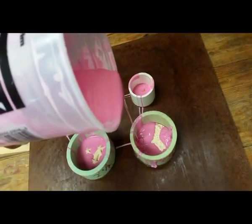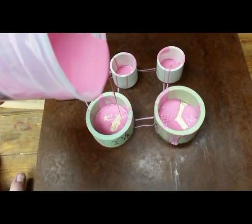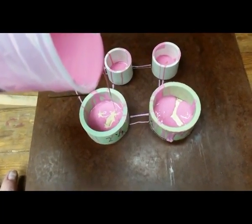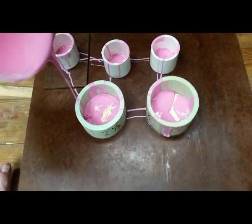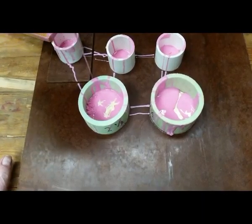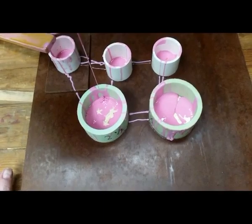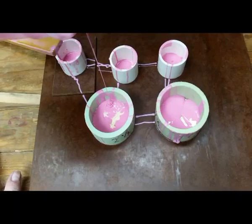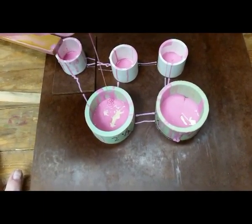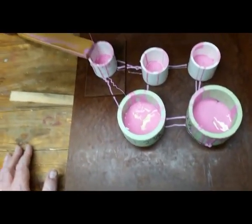These gears have some holes and cavities in there too, so I want to be careful not to pour too quickly on those as well. Starfish is not that critical. They're so small, and the detail in it is so small and shallow that they do pretty good. Go ahead and pour on those. So it fills in the details easily because they're not deep. Right. But like the holes in the button, those are deeper, so it will actually trap air in there, and the air won't come out because this silicone is so thick.